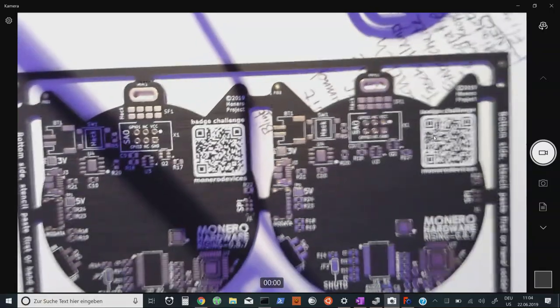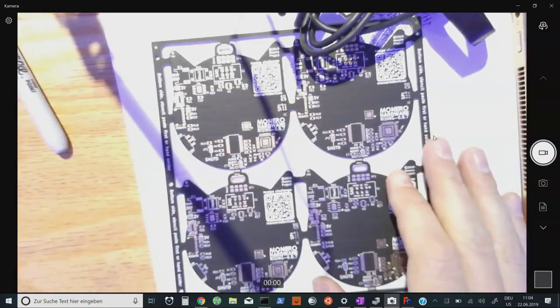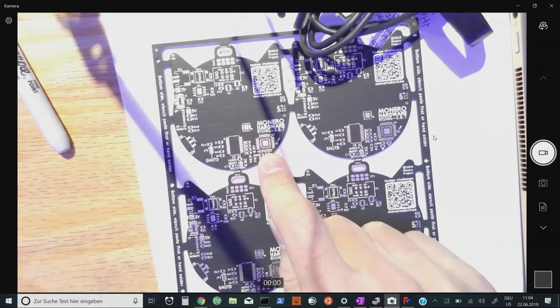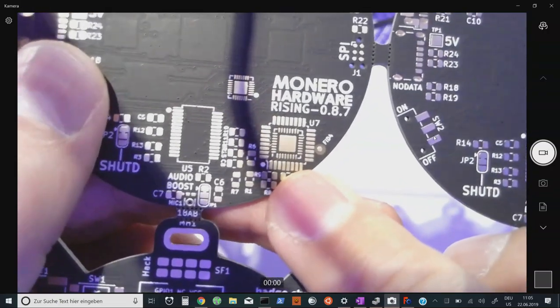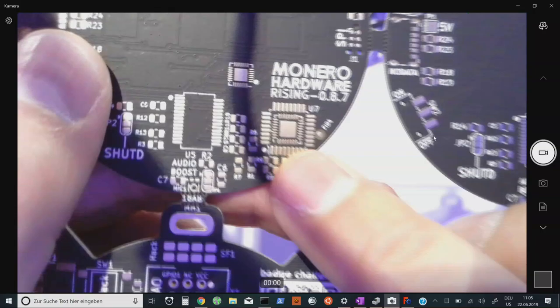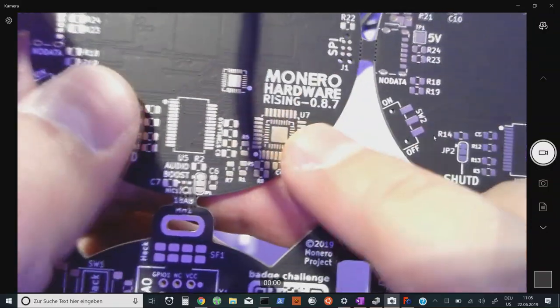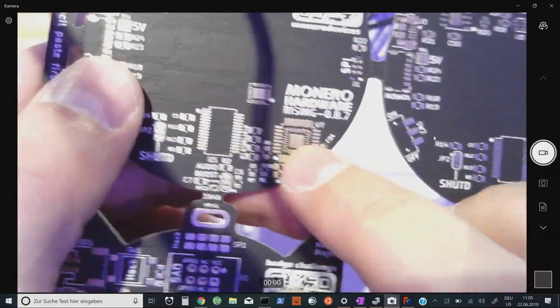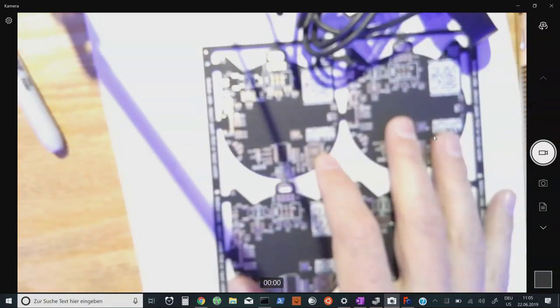This is what the panels look like when we get them back from the PCB printed circuit board fabricators, before assembly. Something I'd like to point out as a pioneering piece of work: we're doing multiple nested footprints. One row of contacts is inside another — what we're doing there is creating one PCB that can support two different parts which are selectively populated. It's a selective mutual exclusion. We got that idea from Wixer, the designer of the DEF CON badges.